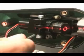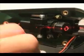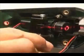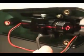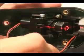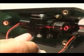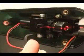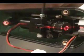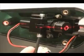To manually adjust the laser, loosen the silver screw first. This will loosen the laser within the roll mount. Next, you will loosen the black screw, which will loosen the laser from the laser sleeve. It is recommended to slightly loosen the green screws, but this step is not always needed. Now the laser will be able to move freely within the roll mount.